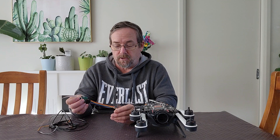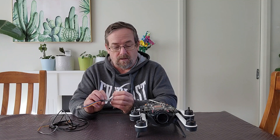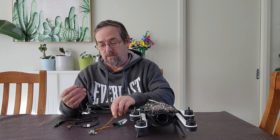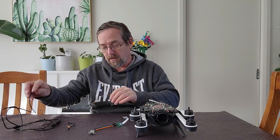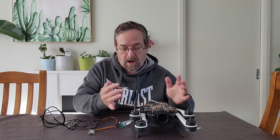Previously we'd have something like this — this is a prototype I built ages ago, which is my SD card board with a ribbon cable which I would plug in. I would then also connect my serial to TTL device and plug that into my computer, then take the can off and probe it while powering the unit on.